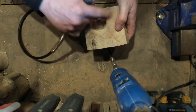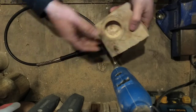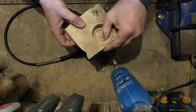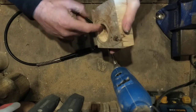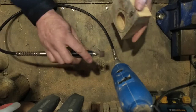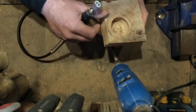Once that's done I will cut this out and sand it up a bit, and maybe thin it a little — it doesn't need to be quite that chunky. Like I said, you can do this with hand tools. You don't need to put the recess in — you could just get your piece of wood, put a hole in it, and you're done basically. But I like to put the recesses in because I find the cushions fit better. I'm just going to carry on making the recess and then cut it out using this multi-tool, sanding around the inside until I've got a bit of a lip.